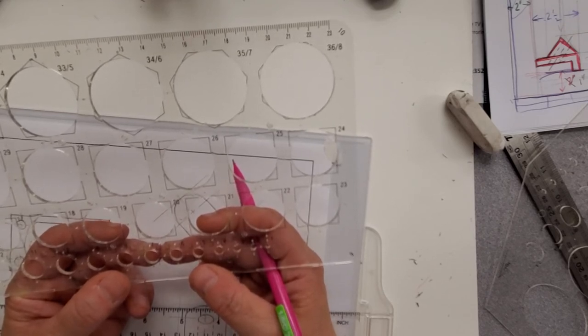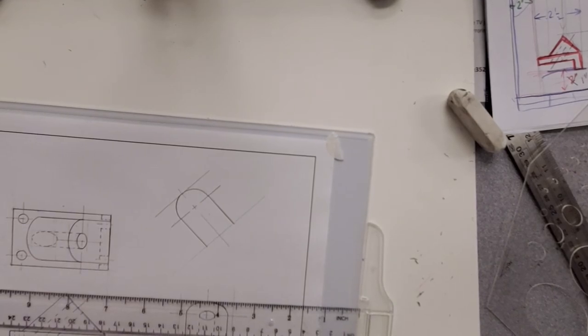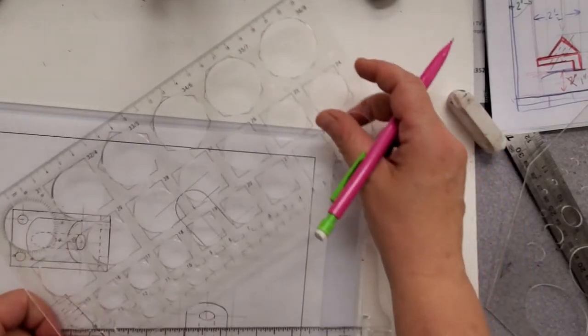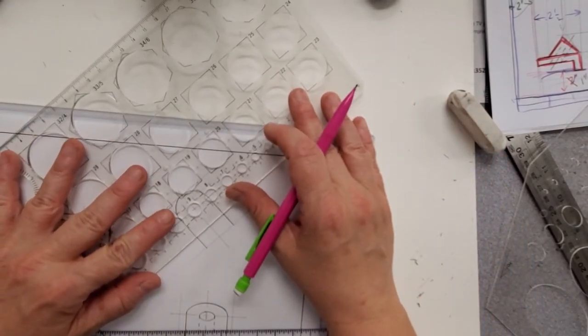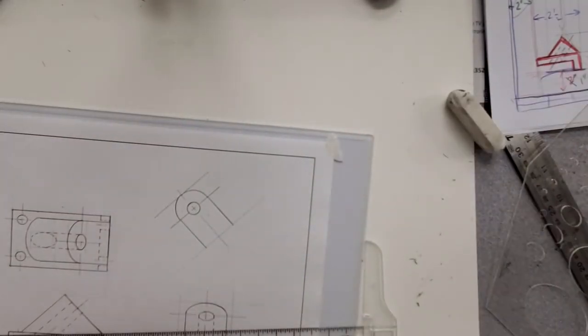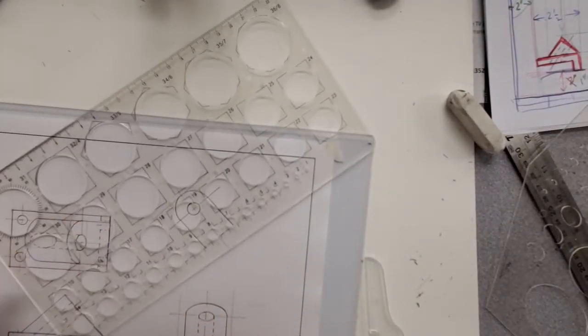Take 0.375 and divide it by 25.4. Is it divide by 25.4 or multiply? Who remembers? Yes, multiply. So take the inch value, 0.375, multiply it by 25.4, and you get? 9.5. 9 point something, yes. So it's 9. Aren't you glad I gave you metric templates? I'm forcing you to convert back and forth.